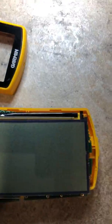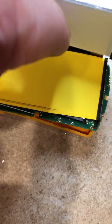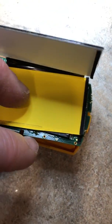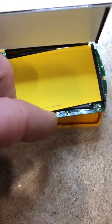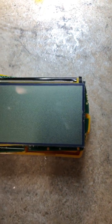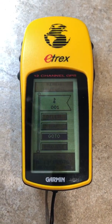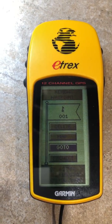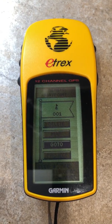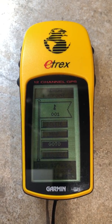I put that chip on the known good unit underneath this insulator here — the chip is under here. And there it is. Once I put power to it, it does a self-check. That came on and I navigated to the waypoints and was able to find all of the customer's waypoints. Not only did the unit work completely functional, but now all the hundreds of waypoints that were taken before are also available now to the customer. It's a good data recovery success story.